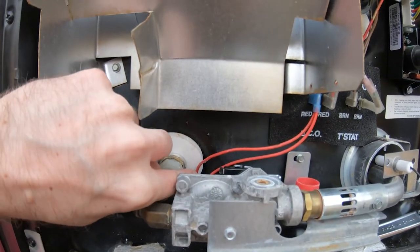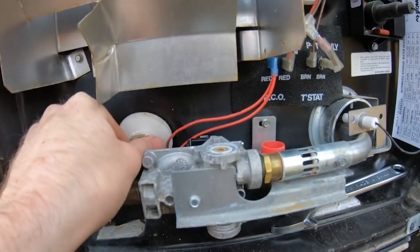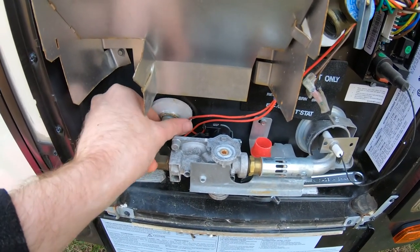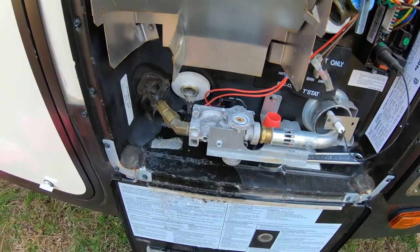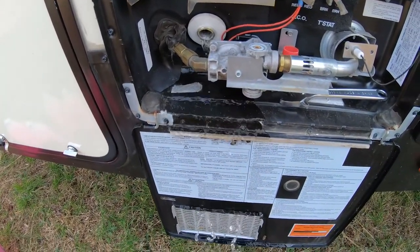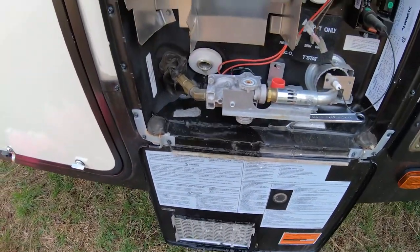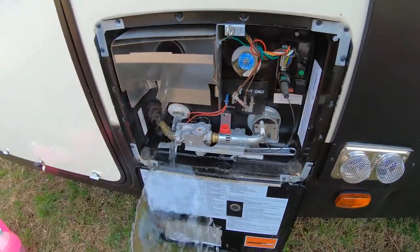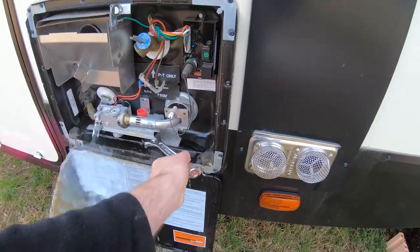You've got to get a good grip so you don't destroy the plastic. So there's definitely some room for improvement on this water heater, at least the drainage port. Good thing though, if you do get this thing started with the wrench, you can finish it off with your fingers. Stand back so you don't get water all over you. You don't really need a bunch of Teflon tape to plug it back up — it seems to seal pretty well. I haven't had any problems with leaks. This is just a six gallon tank, so just let that drip off the side. Might as well open this up to help get some airflow in there to get it flowing out a little bit faster.